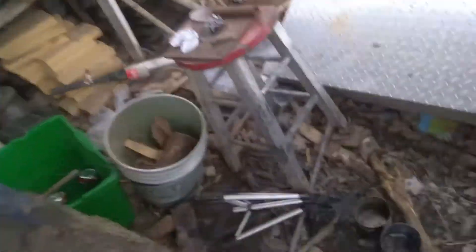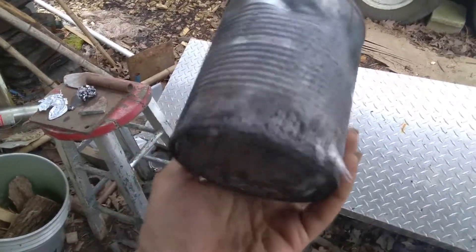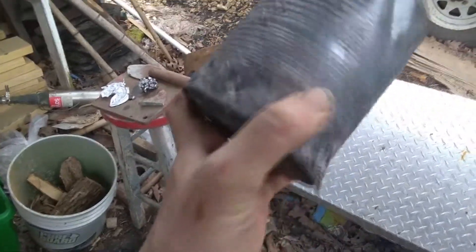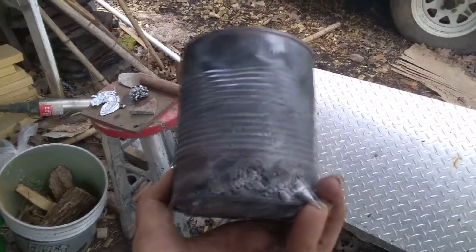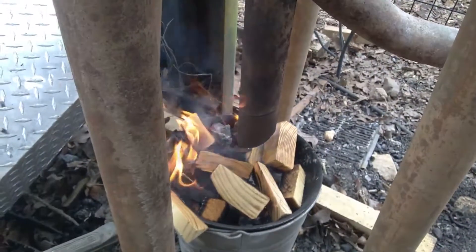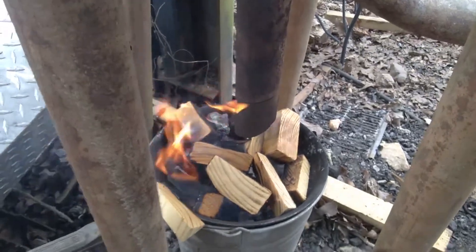Okay, update on my update here: you do want to be careful — I am not saying these are any good. Keep your temperature just high enough to melt aluminum and keep your can from burning, because I let my temperature get away from me and now aluminum went down the pipe under my forge. So I've had to get creative because I need to heat up the aluminum to get it back out of there.